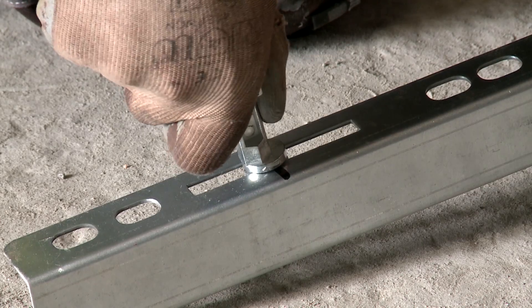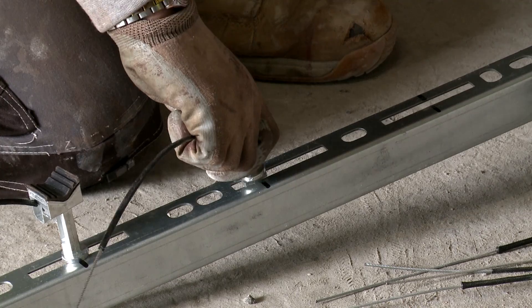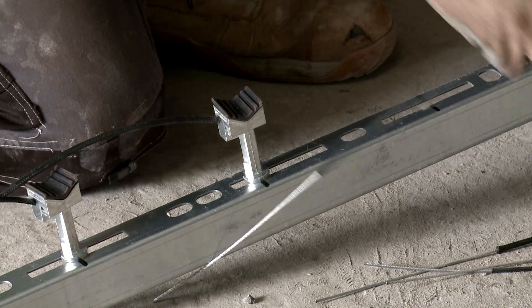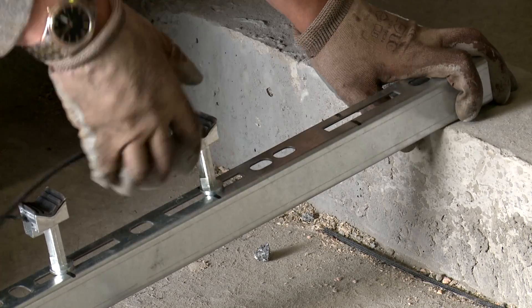Also here, the new product development is the twist clamps that attach to the pipe brackets. So rather than having to adjust with pieces of threaded rods and nuts, the guys are simply just getting the twist clamps out of the box, quarter turn, twist into the bracket — job done.